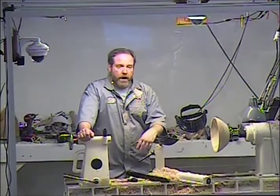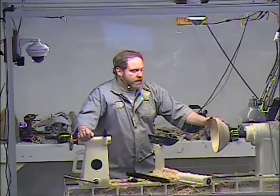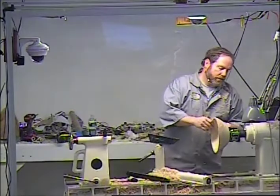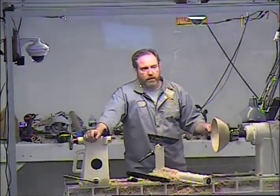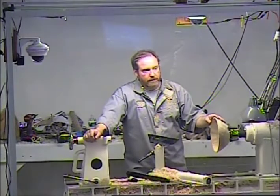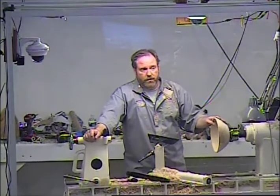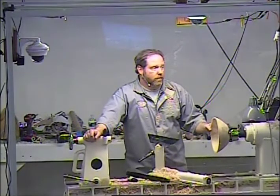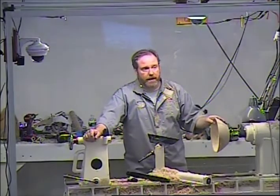Or get a cheap moisture meter. That's what I use. I just jam the needles into the tenon, which is going to get mostly turned away anyways, and I periodically check the moisture level of my bowl blanks. I think I got mine from Woodcraft probably 15 years ago, and I think it was like $30. They're well worth it, especially if you're interested in green bowl turning. You kind of need to have one.